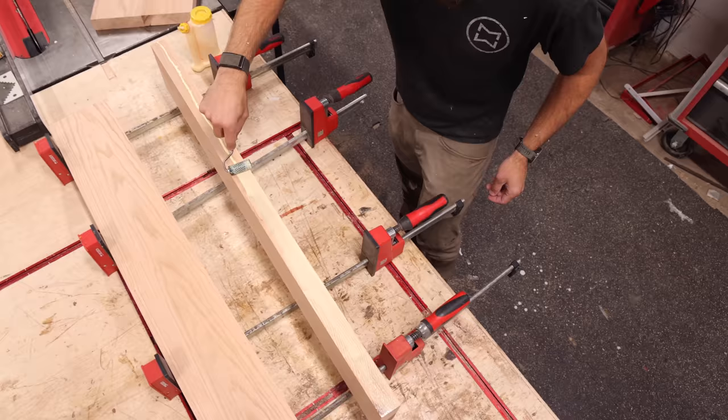Pretty cool. One of the last things I want to do on this big chunky arm is add a little detail at the bottom to get some relief. Anytime I build a table I like to get at least three points of contact, but I don't like large long pieces of wood laying on the ground. Here in Pittsburgh you're very rarely gonna find a floor that's flat, so by making this detail we'll have less surface area touching the floor, which should be nice.